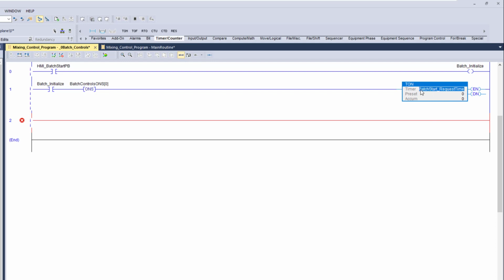timers just real quick. So this is the timer on, and there's a timer off, and then there's a retentive timer. Now the timer on is saying anytime that the examine on is actually, the rung is true, so the flow of energy is from left to right on ladder logic. Now in different program languages the flow of energy is different, but in this instance the flow of energy is from left to right. Now in this instance, if the timer on delay is active, that means the rung is true, then the timer will be functioning.